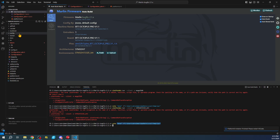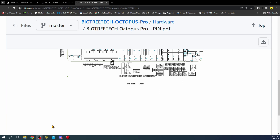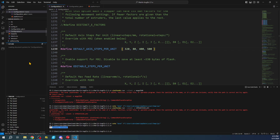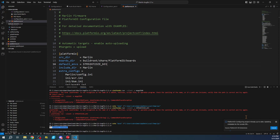It looks like there's an issue - maybe I opened something incorrectly or something changed. Looking around at the output, it says the PlatformIO installer finished and to please restart VS Code - it may have updated. So I'm going to close it and reopen. Now that it's open, let's see if we have the normal build button.